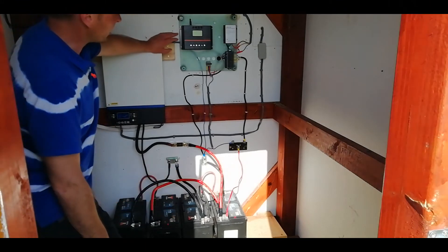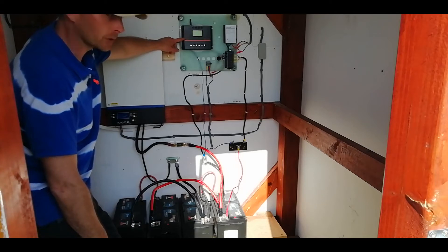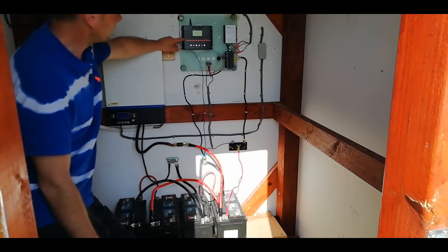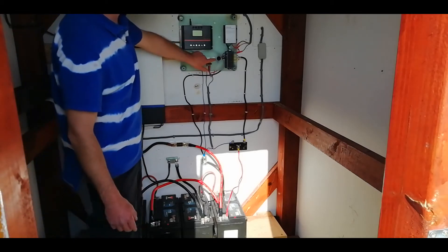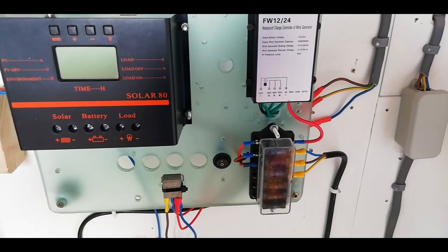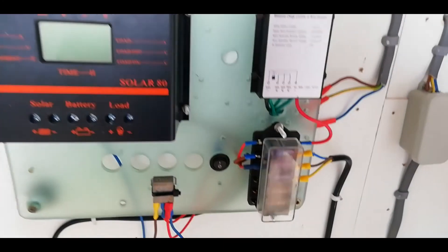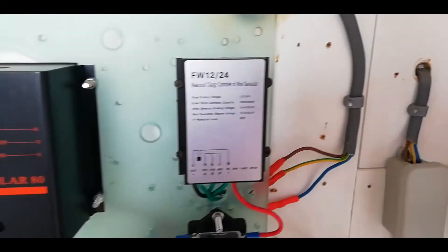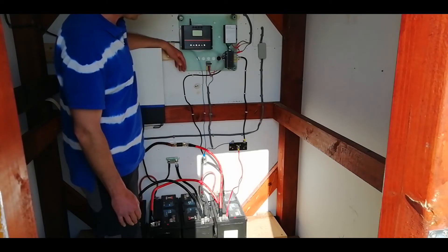The system is now completed and fully reassembled. There's a lot less there than before - I've kept the old solar controller, which will also run on 24 volts. We lost the morning panels below when we had to set everything into a string, so we're getting less charge in winter. For the wind turbine system, I've set up a switch and relay using spare parts from my old motor trade days. The switch operates the relay, which switches the heavy current through the control unit, so it can be switched off on days with no wind - saving power drain. We've also set up a small fuse board for the interior light and all systems.